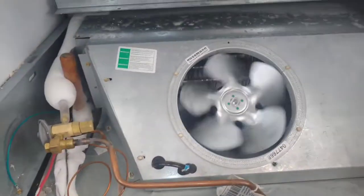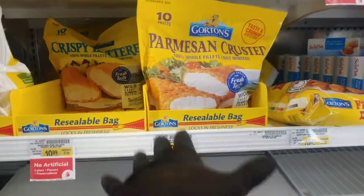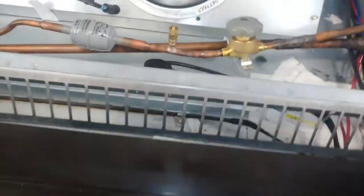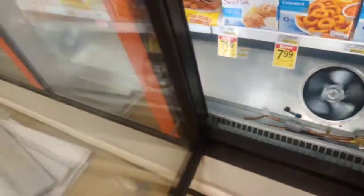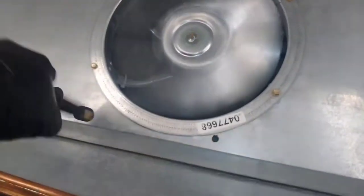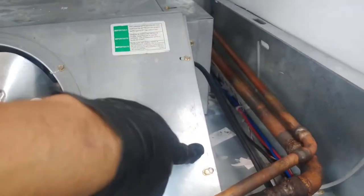This case is frozen. To get to the coils you've got to take these grills out, bring them over in front of an open shelf and rotate them. Sometimes you have to take the shelves out completely and twist them to get them out diagonally. Get all those out — there are back shelves too, and you definitely want to shut off the refrigeration and unplug the fans.